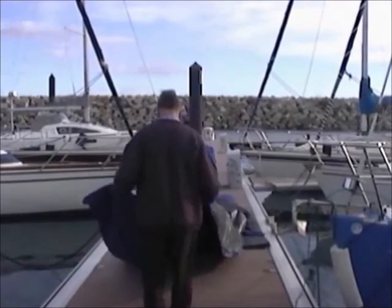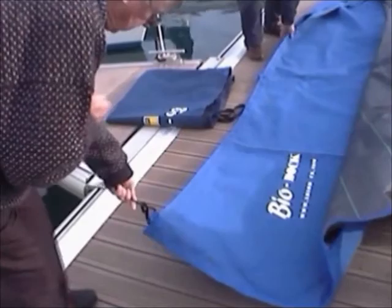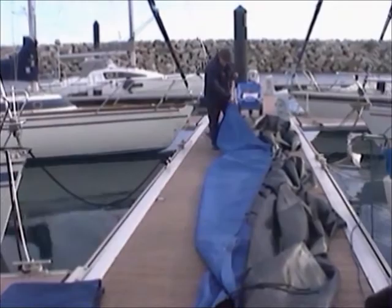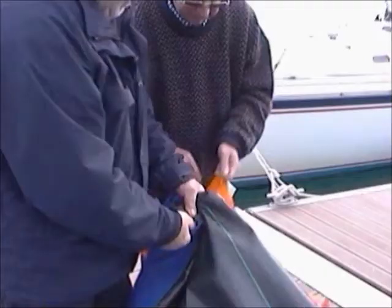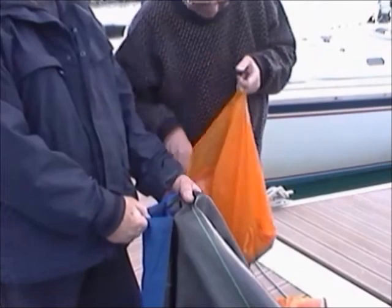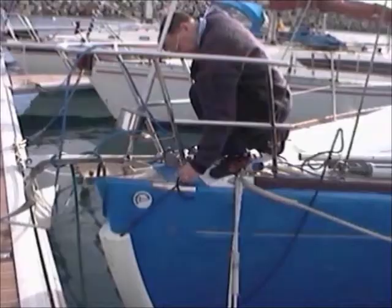When using BioDoc for the first time, roll it out on a flat surface and attach short lines to the loops provided along the top and back edges. The cover can then be attached to the gunwale. Attach temporary long lines to the back panel in order to lower the cover under the keel. The underhull membrane is intentionally buoyant so that it floats up and hugs the hull, so it is necessary to weigh it down for installation. Ballast pockets are supplied on the rear panels — in this case, pebbles are providing the necessary weight.